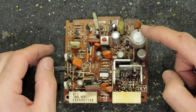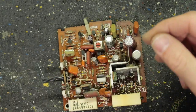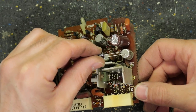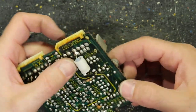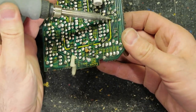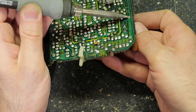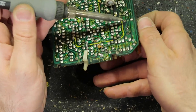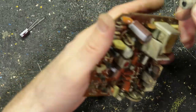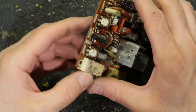C11 is this giant one right here. C313 is right next to it — that Coke-can-looking one. In case you're wondering, you can go up on voltage but you can't go down on voltage. If you have a cap and you're replacing it, you can put in a higher voltage — it's not going to ruin it, in fact it might be a bit better. But you can't alter the microfarads.